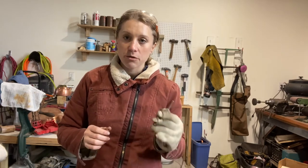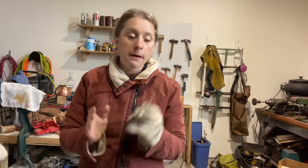But it's a really finicky repair. Once you have both places cleaned — where the spout abuts to the body of the copper pot and the copper pot area where the spout is abutting — you're going to have leftover tin ideally but you shouldn't have any more dirt. I use just a dremel with a little stone tool so that it's a smooth, clean, and quick way to grind off not only excess material but the dirt.